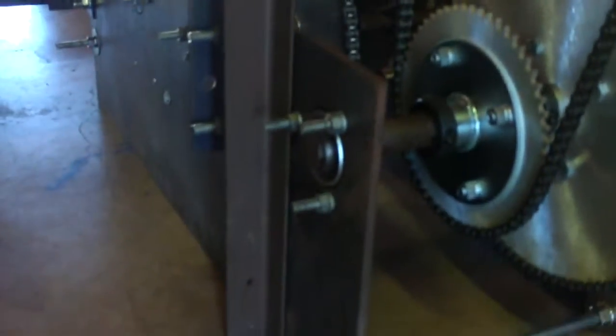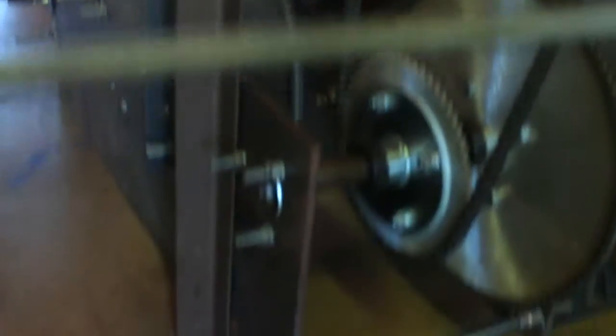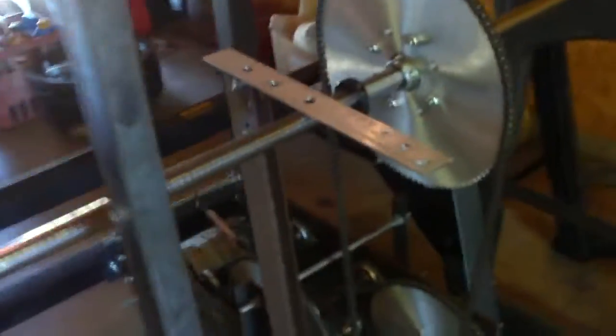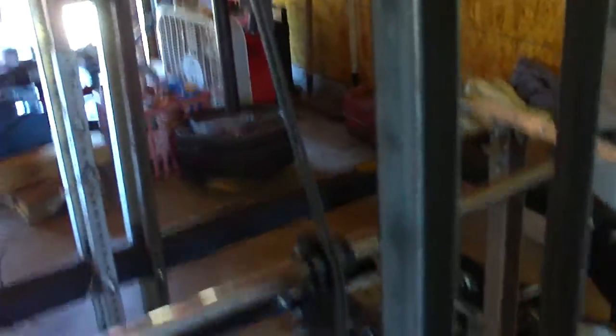What I'm doing right now today — you'll notice this little piece of aluminum sitting there and a little piece of angle iron going along the side of the gearbox — I'm measuring the distance from the floor up to the middle of that shaft so that I can calculate the chain links that are going to be required. That's tedious, man — it's down to the 32nd of an inch — but it's worth it to get it right the first time so I don't have to come back and revisit it.